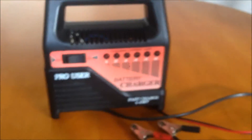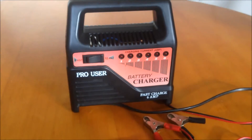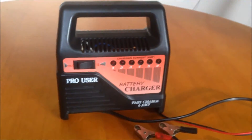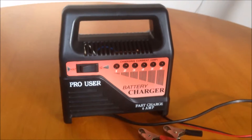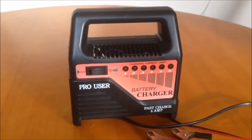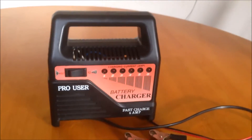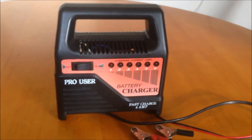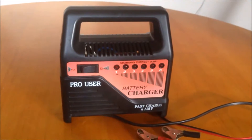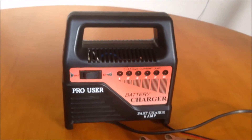Sometimes a simple charger is useful because a smart charger, if your battery voltage gets too low, it won't charge — it won't start. My smart charger will only charge if the battery voltage is more than 7.5V. So this is very useful. It could also be useful if you want to do some overcharge — sometimes intentionally you want to overcharge to restore or recondition the battery.